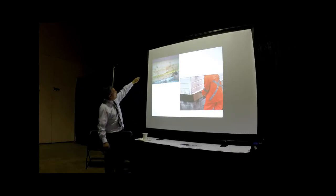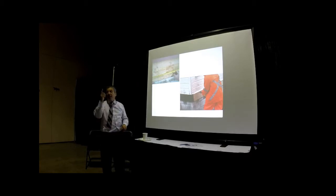As you can see, on the top it's nailed to the house. In the bottom, it's nailed to the sill plate that we anchor with the anchor bolt. So now we have a good masonry wall, and we have a connection that grabs the house and ties it back to the sill plate. That sill plate also is tied to the masonry stem wall by the anchor bolt.